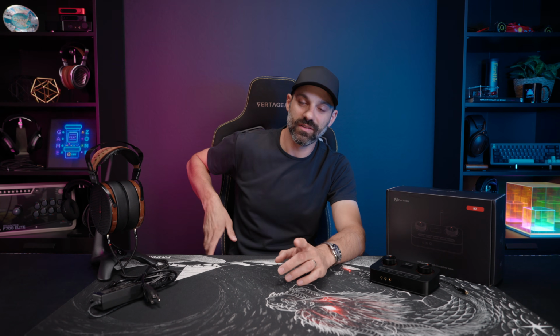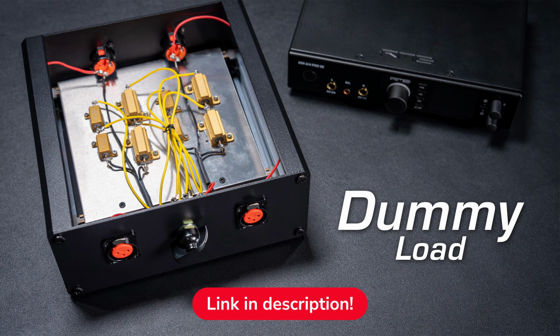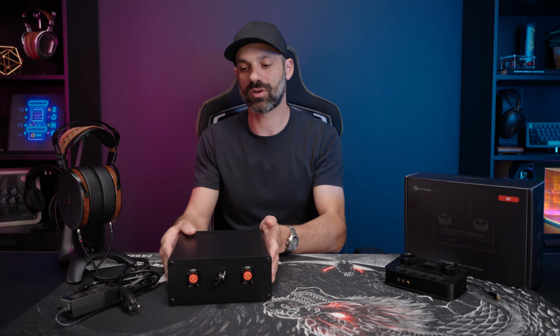It's far overkill for what most gaming headsets are, but naturally, with a bold claim like that, I had to test it. Now, thankfully, I built a headphone dummy load. This I have a dedicated video on, and with this switch inside, I have different very low tolerance resistors inside to simulate a 16 ohm, 32 ohm, 150 ohm, and 300 ohm load. I have a whole video on my testing methodology and why I did this, so if you want to learn more, I'll have a link in the description for that.